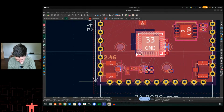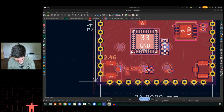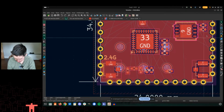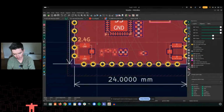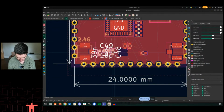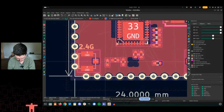All right. Trying to deselect the pad behind it. Let's turn off some stuff here. If you're new to KiCad, when you're doing a lot of selection stuff here, it's important to have a good feel for how to selectively hide things so that when you're trying to do some of this stuff, it doesn't burn you. So like I just turn off the back, one there, and I'm just doing that to do this. And then of course I got this one upside down.